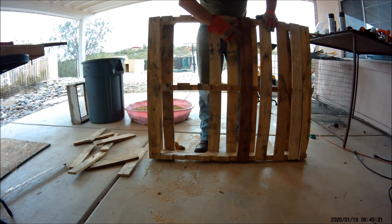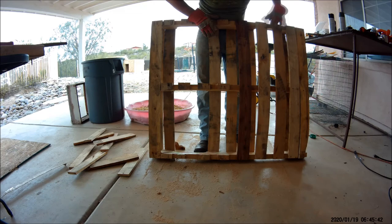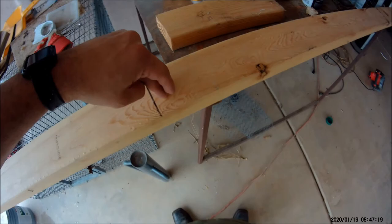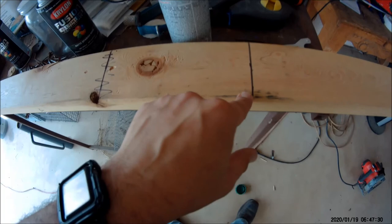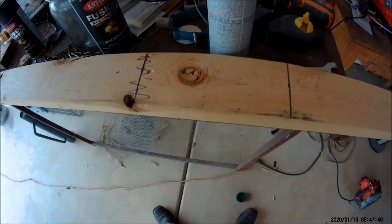I'm going to put my netting on this side, my wall right here, and the dust bath in this little area. I got my wood marked — two marks: three feet is where the pallet starts, and I was going to go six feet, but I decided against it because I need to put a roof on it. So I'll go 80 inches for the two front legs, and the two back ones will be about three inches shorter at 77 inches tall. Let me get my cuts done and then we'll get started on the build.